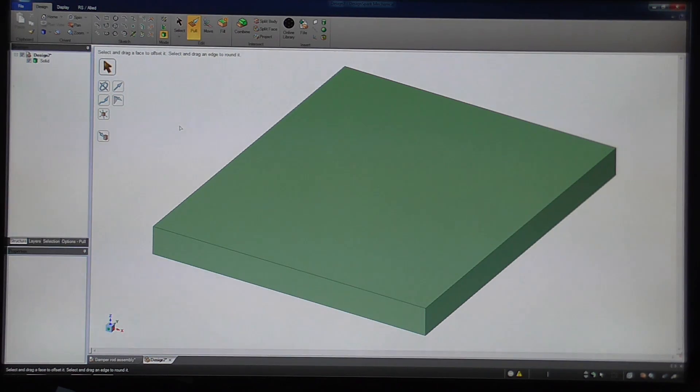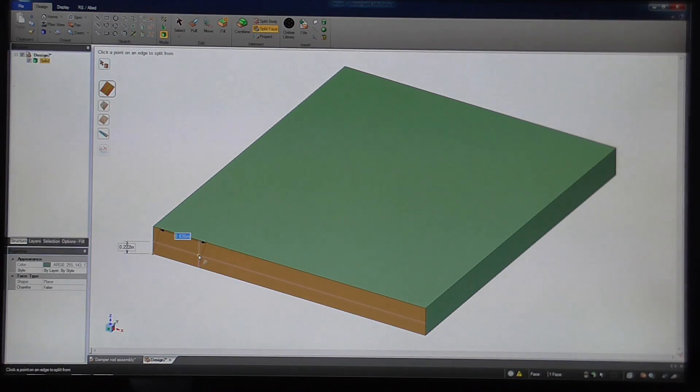So now we're effectively going to be machining this block, and we want to create the feet down here. I'm going to split that face — I select that face to be split, and you see I get a horizontal and vertical line — but we don't want to split it horizontally. So if I come down to one of the edges, I only get the split in one direction. The box that's highlighted is a percentage of the length of that face, so we don't want that; we want the other box.